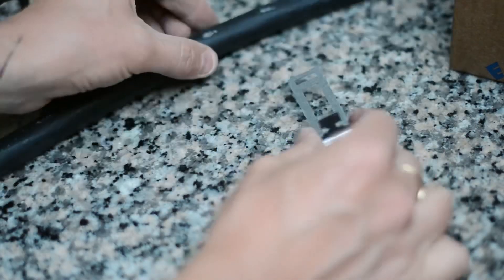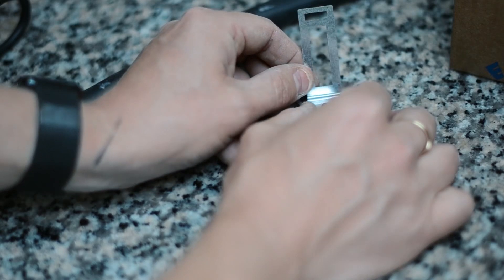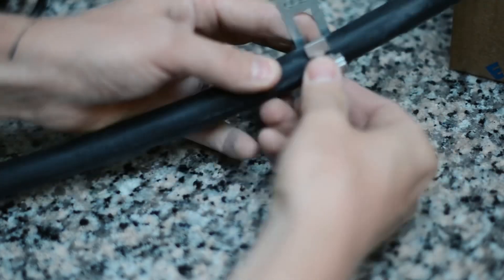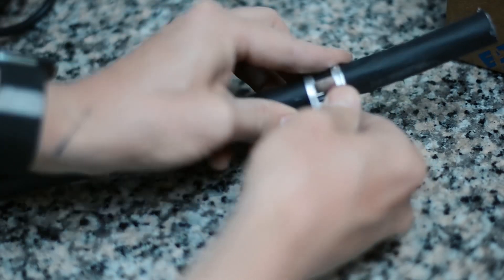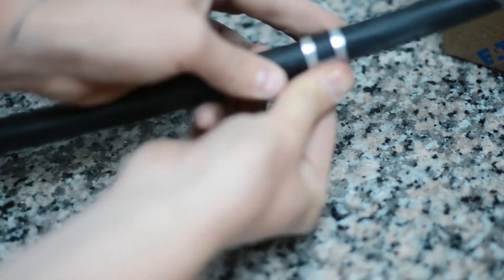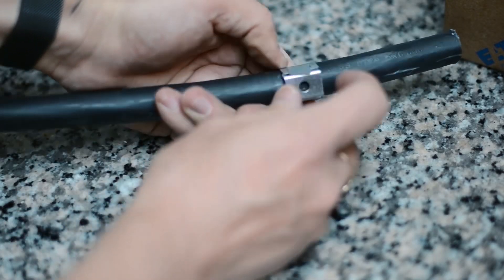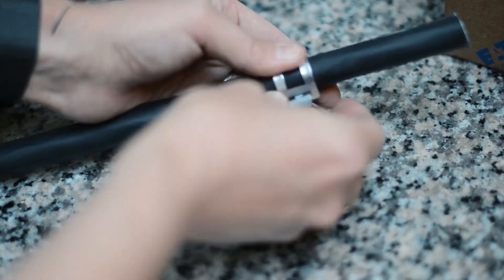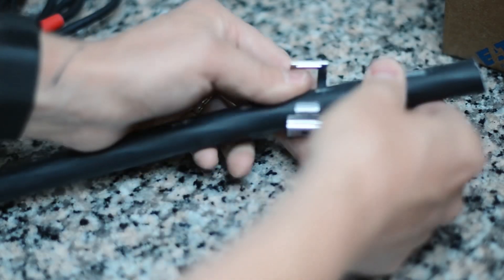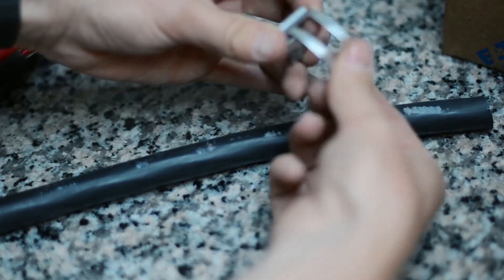The armoured goes in like that - you screw this down to your surface, then the cable or conduit goes on, this folds over, that little slot goes in, fold it over like that and you've got a nice solid fixing with a screw hole. Dead easy, and you can remove them later on. They're a bit like a modern version of the old twin and earth clips, made by D-line - I'll put a link in the description.